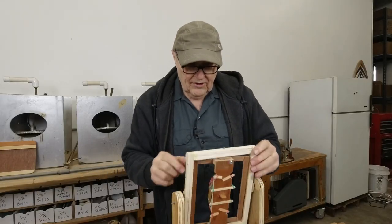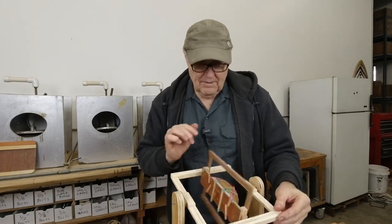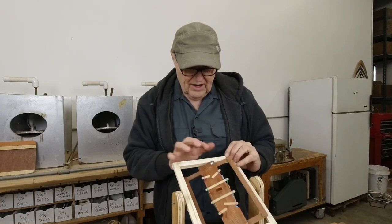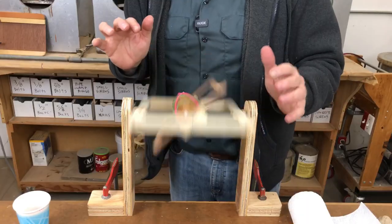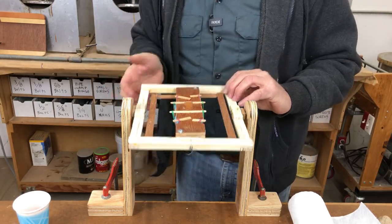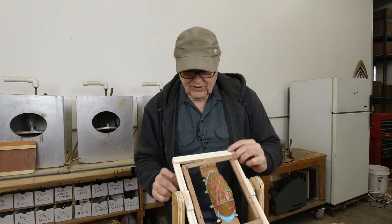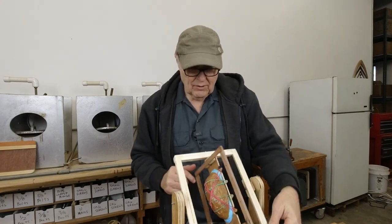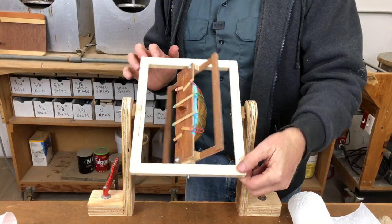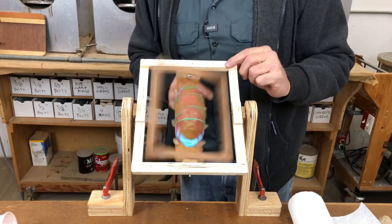Let's spin. I have colored the resin so you guys can see it better — that's the only reason I did it, for you to be able to see it. What you're doing is you're coating the mold with resin. The resin is just forced to run around the walls instead of stopping in one place and pooling, which is what you absolutely don't want it to do.